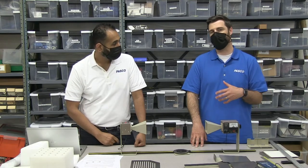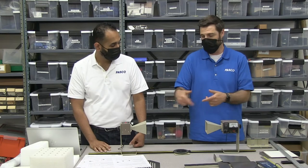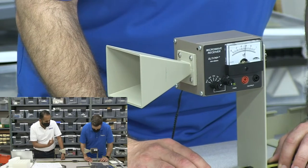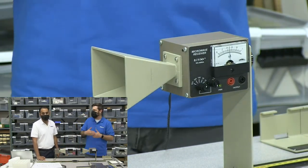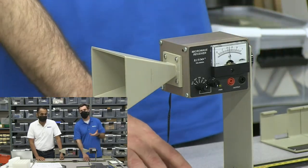The resonators and waveguides actually act like a reflector to some degree. The microwave is emitted, comes down, it's received here, but some of it gets reflected back. We get this bouncing back and forth between these waveguides of those microwaves, and the wavelength is fixed. If we can get the distance between them just right, we can set up standing waves in between these two waveguides. As you take a look at the screen, we'll slide one over and you'll see — it's going up, down, up, down, up, down — you're cycling in and out of that standing wave relationship. About every half wavelength, as you move this thing, remembering it's going down and reflecting back, every half wavelength you're cycling through.